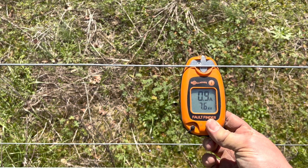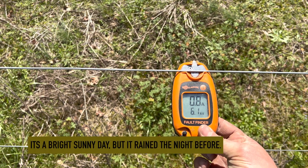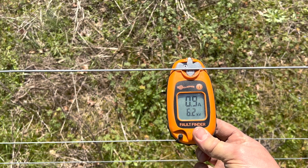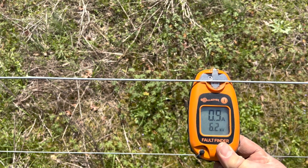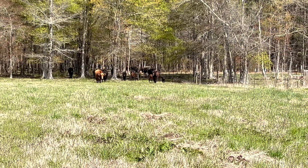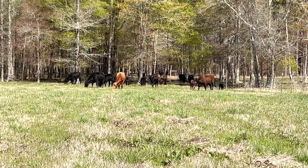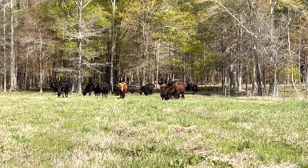That's good enough to keep both cows and pigs, especially if the pigs are trained to the electric fence. However, on this day it was rainy and cold, and in rainy weather the voltage will often be 1,000 to 2,000 volts below. In conclusion, if you have a simple electric fence you can usually find problems pretty easily, but if you have 13 to 15 miles of branched fencing with different paddocks and sub-paddocks, it's really good to test each of those individual lines. I hope you enjoyed this video — let me know what kind of electric fencing you use. Until next time, take care!